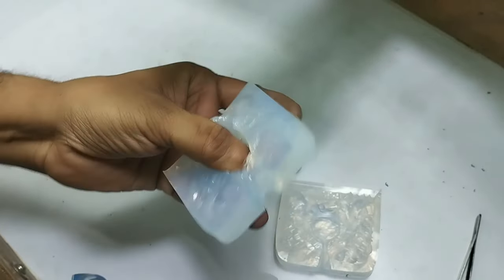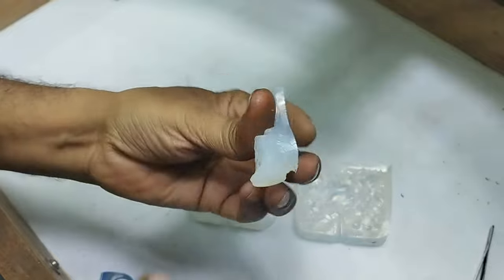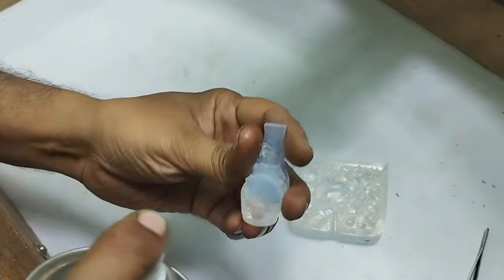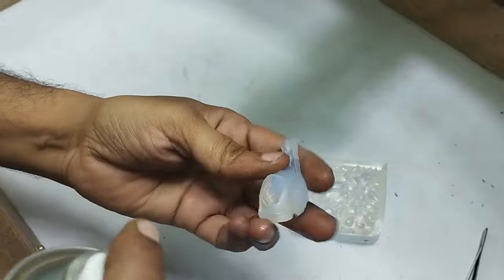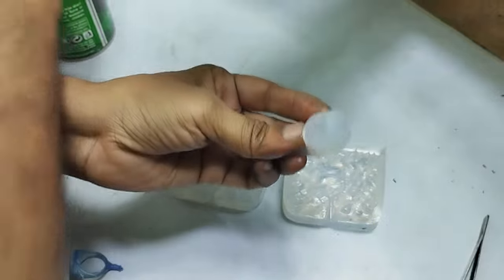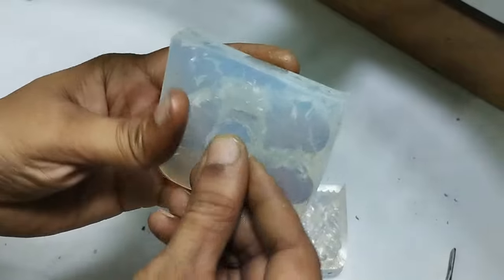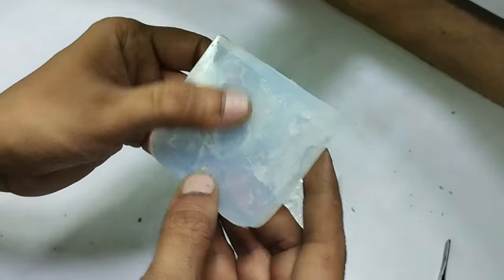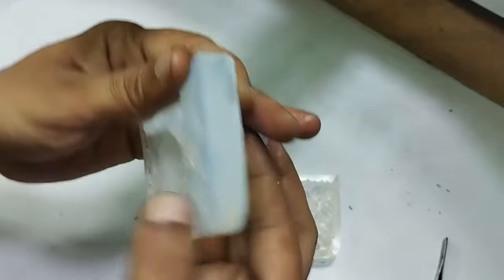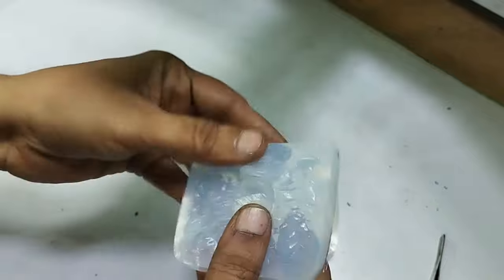So this will make the mold very slippery. You can see just how slippery it is right now. Spray this part also. And sometimes some people are allergic to this spray, so make sure that you are not allergic, otherwise you may be in trouble. So the back side, just fix it inside, so easy. Without spray it was not possible to insert it so easily inside. Whenever you want to inject from the back side, it is placed very well.